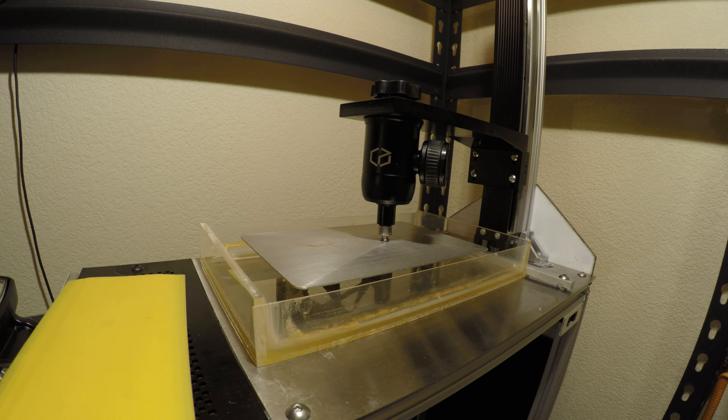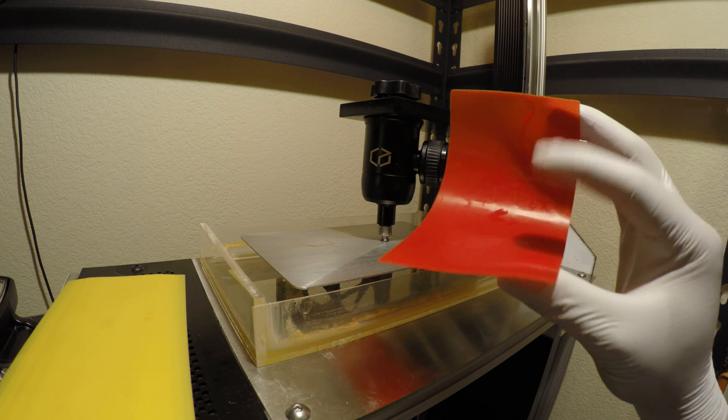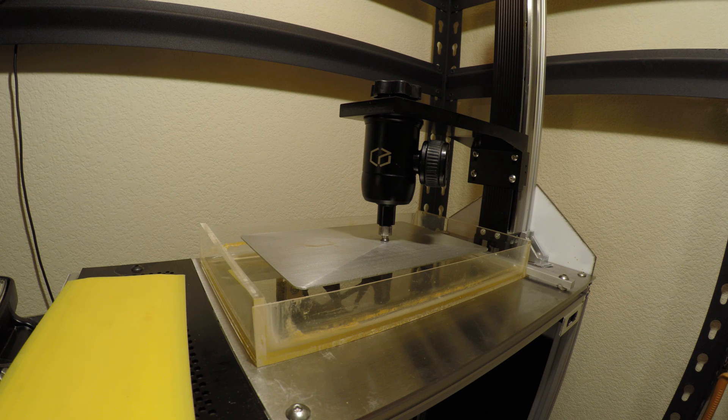What I'm using today is Funto-Do standard blend. The standard blend has characteristics that are good for letterpress, particularly that it is soft. Real letterpress plates are Shore D around 70 or so, which you'd think is about the hardness of the industrial blend, but I printed some letterpress plates previously on different materials and the softer material is better.